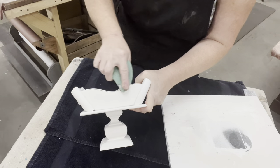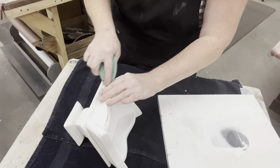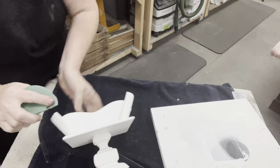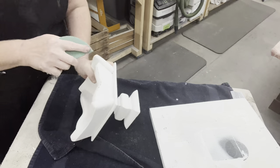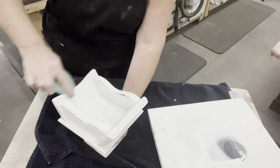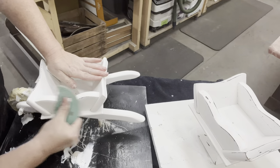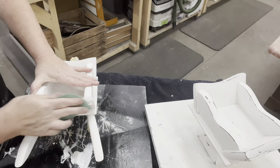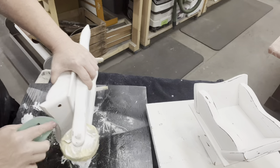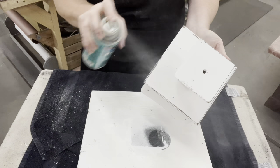After about three coats of paint, plus a touch-up coat for any area that felt translucent, I'm just going back in after the paint has dried using the Kilz paint and primer, and I'm going to go ahead and heavily distress, bringing back some of that beautiful wood underneath. This is just going to pop out those details that were kind of hidden in that brown wood. Now that I have them distressed the way that I like them, I'm going to seal that white paint in using some polycrylic.